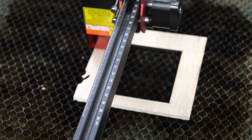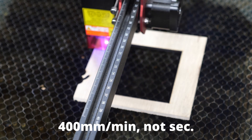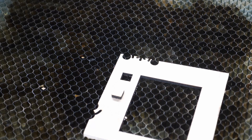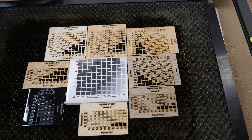Once you become experienced and you've got a good idea of where the settings will be, you can just make a little square - cut a little square out, thinking that should be 400 millimeters per minute, three passes, 100 percent power, that should do it. So a little half inch square, and there it is. Once you get some experience you can do that for quick tests, or if you're switching to a different batch of material. I'd stress the importance of it because we get these questions so many times - all of us laser guys on YouTube get these in emails and comments: what settings do I use, what speed, what power? You need to run some tests. This is how to do it - it's very very easy.